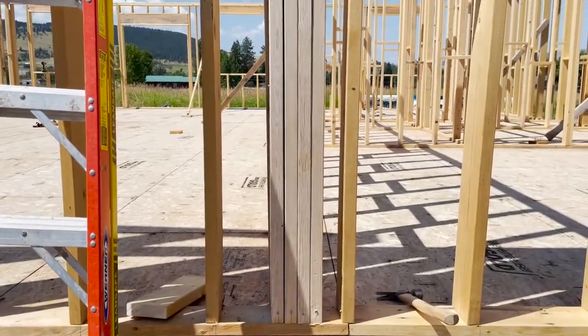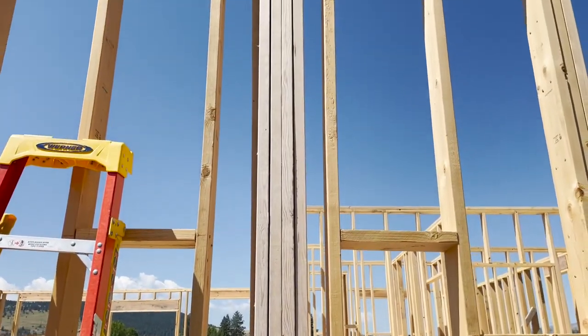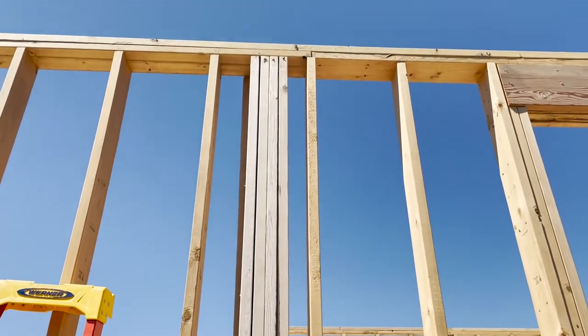As you can see, I've got four 2x6s, and those are set 16 feet 6 inches according to the plans. Well, I finished with the structural supports on both sides for the girder trusses above. Additional support acting as a true beam. So there's this side and there's the other side with the porch that has the beams connected directly to the top plates as well. So we got the structural supports in. I'm pretty happy with that. A little bit of work, but got her done.